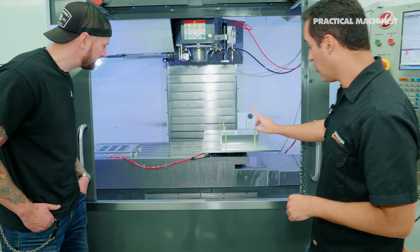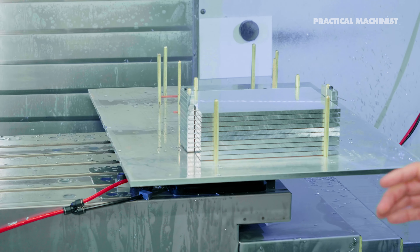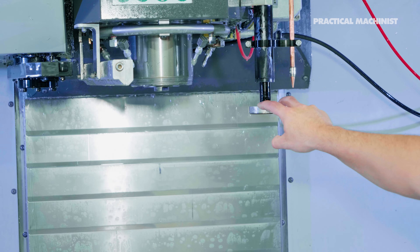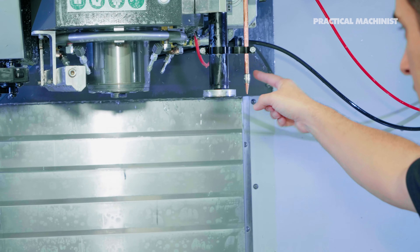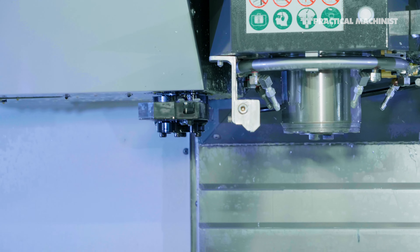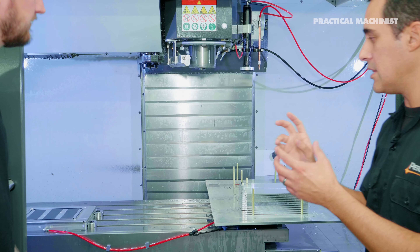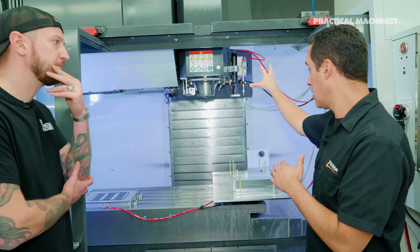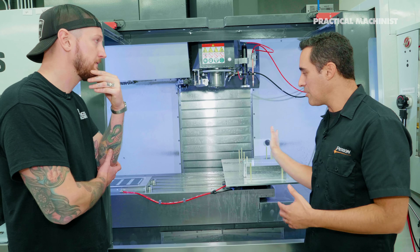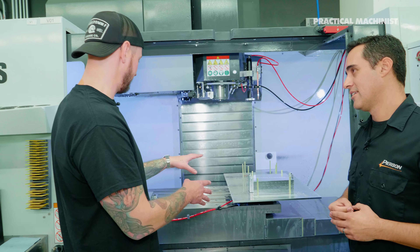We have this plate sitting on one of our pro pallet system pallets so it can come on and off quickly - that whole plate is on top of one pallet, with its own work offset and origin for probing. This pneumatic gripper uses positive air pressure to generate a vacuum, with a blow-off nozzle. It goes in, cleans the chuck using this 18-inch air knife, then the air nozzle blows off the top of the part, the vacuum cup gripper picks it up, loads it, and using the built-in relays at the back of the control it turns on the vacuum. When machining is done, it blows off the part, clears chips, picks it up, and drops it in the finish stack.